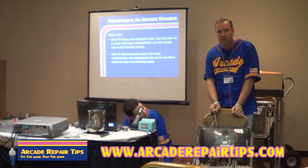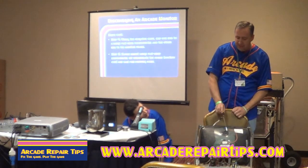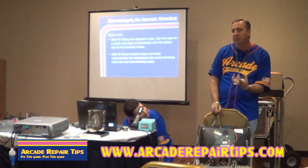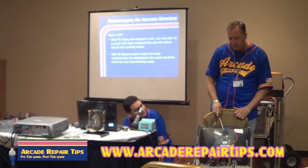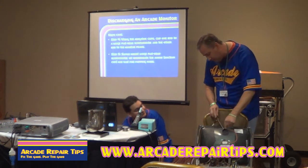Now, here's what you may not know. Most of the time, when you get popped, it's not this that does it. It's inside that hole that this goes into. It's the tube that holds the charge most of the time. So very simply, we're going to slide our screwdriver under here. Of course, I'm real safe with my bare hands, but.